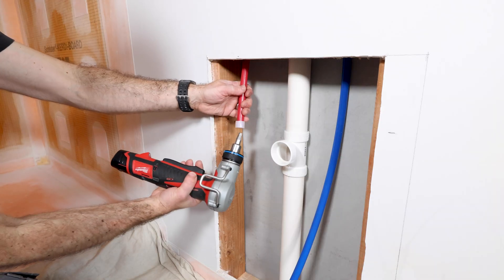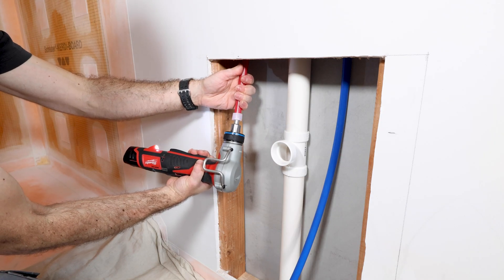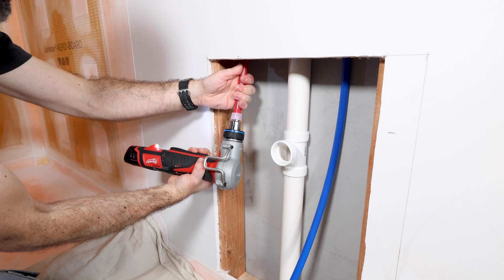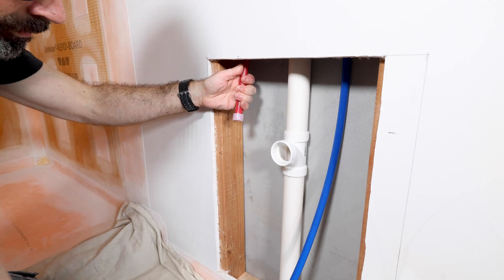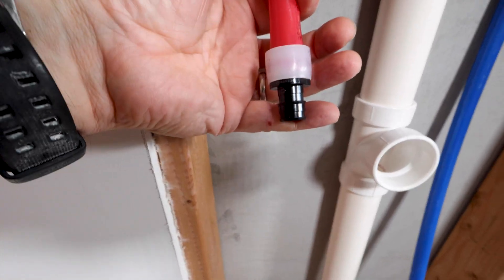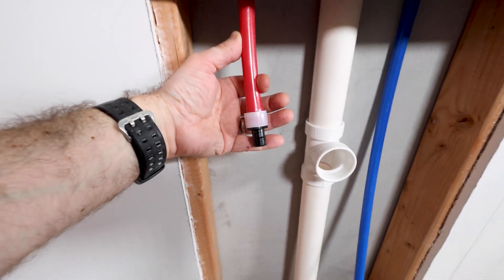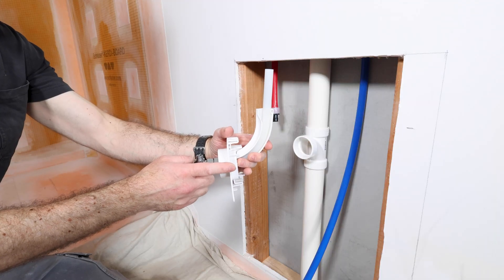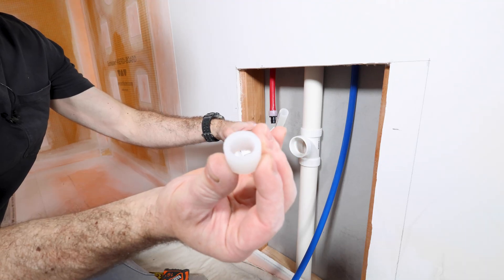This is super fast. I'm using a Milwaukee M12 expansion tool. I do five to six expansions for the tubing as well as the expansion ring. Then I simply slide on the coupling. The nice thing with the fixture outlet box is because it already has the PEX-A installed, I just do the exact same thing for it — I slide the expansion ring onto it.